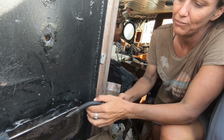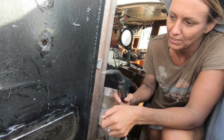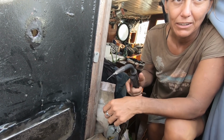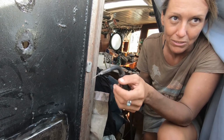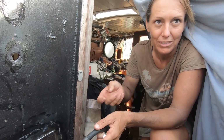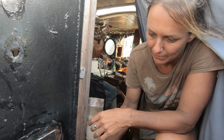What you'll feel if it's not right, and you're pressing the gun, it'll go ting ting ting ting. Oh yeah, I remember that. Yeah. That means it'll be probably too fast, so we'll have to slow it down a touch for you, or you're doing it but it's disappearing, then we've got to do the opposite. Too hot, yeah. Okay. Yeah, keep going back and forth probably.